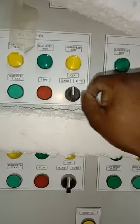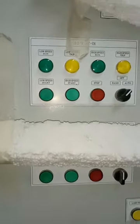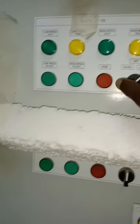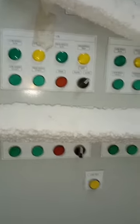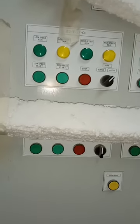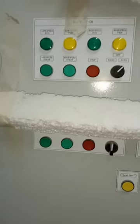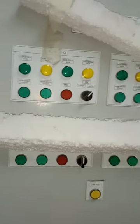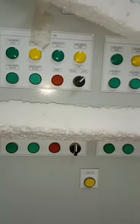If you turn to Auto, the fan will operate automatically via the BMS or through the fire alarm system, where third-party cables leave from a relay control module to supply the fans. In BMS mode it will be operated from the BMS controller; in fire alarm mode it will be operated from the fire alarm control center. In the case of a fire condition, if the fans are off they will turn on automatically to push out smoke.